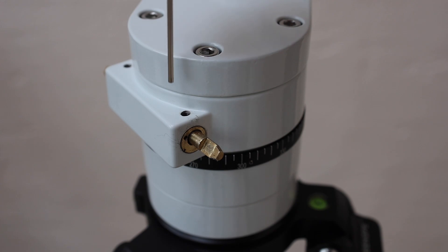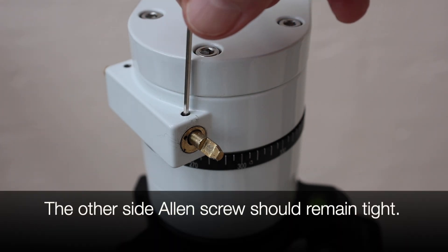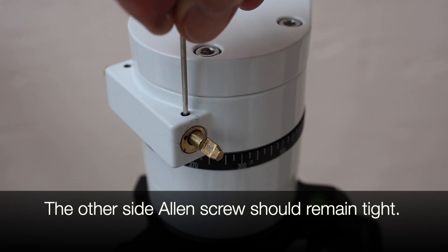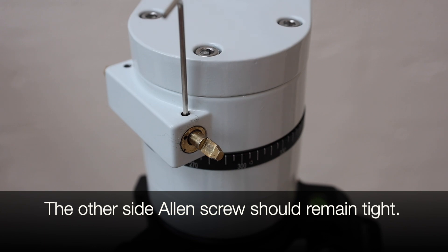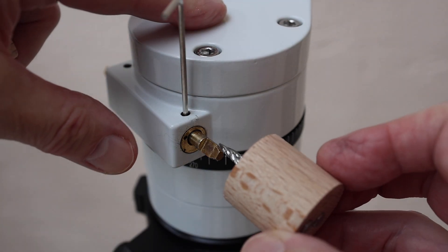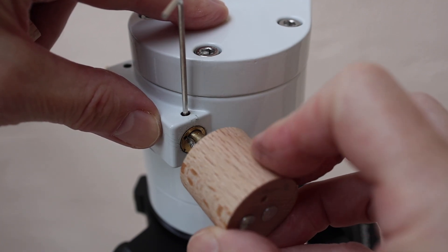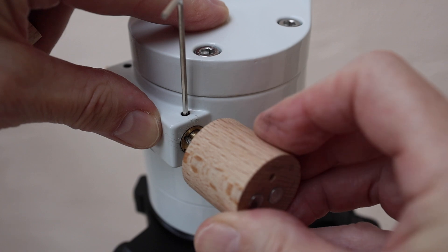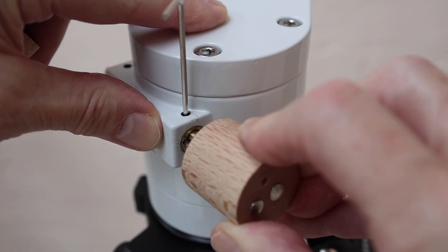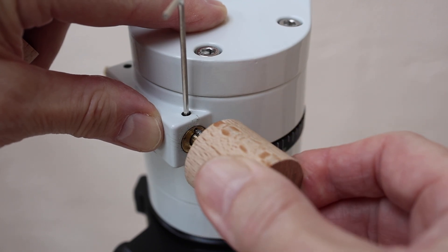For resetting the gear contacts, you first need to loosen one of the allen screws on one side. Then, using a spanner device, rotate the brass worm gear housing in a way to achieve gear teeth contact. You will feel the resistance when the metal gears connect, and then tighten the allen screw back up again to hold that position. If necessary, repeat this on the other side. It is simple, quick, and easy if you have the right tool.